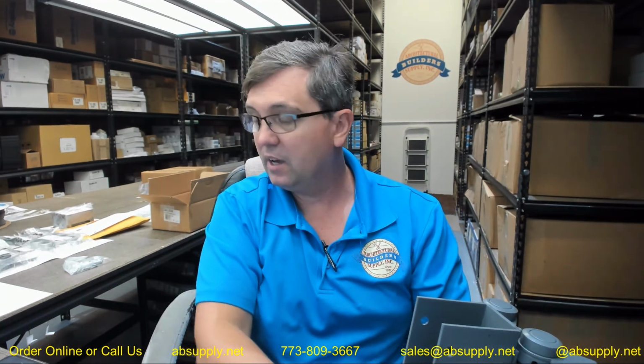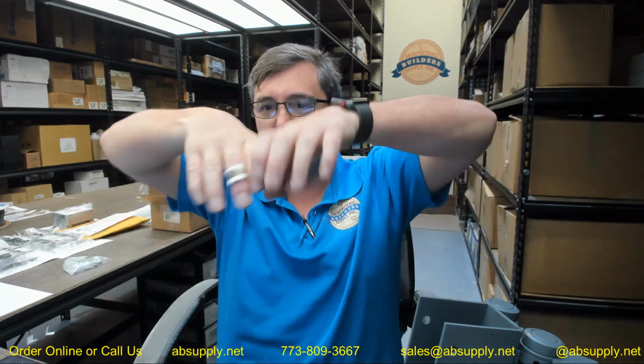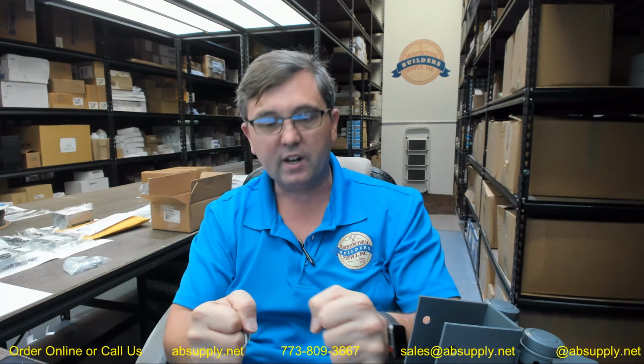Okay. There's nothing else to discuss on these, other than if you were to radius your doors, I would use, I forget the size of my round over bit. It might be 2 3/4 diameter into a 1.5 horse router where I've cut the base of it out, so my big giant round over bit can fit in the bottom through my base. And I'll set that bearing so that the bottom part of the cutter hits halfway through the door. And I'll put that on the edge of the door and I'll just run it down.